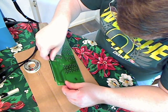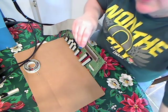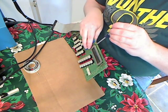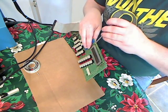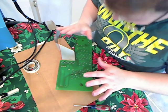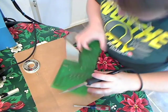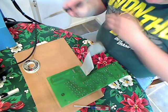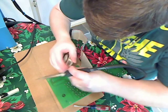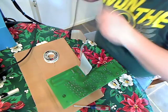You can check if the pins are free by pushing on them just a tad. I'm going to use a small flat head to see if it comes up. Those two were perfect. The most important thing is patience — sometimes your connections aren't going to come off right away. In that case, re-solder the particular joint that's giving you trouble. It's also very helpful to have additional light, like a flashlight, to get a better view.